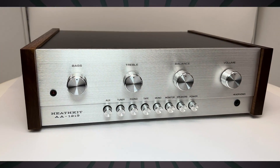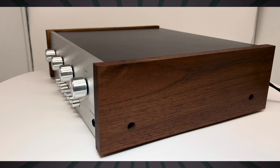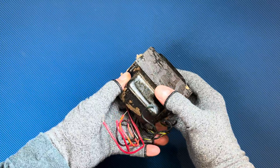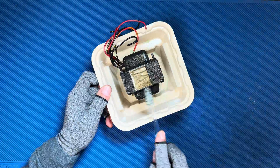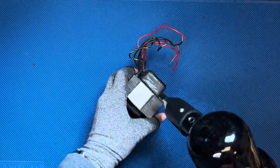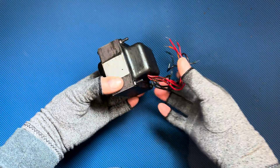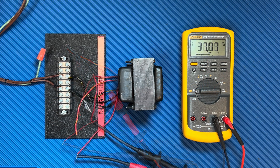To get to this point there were a few things I had to do that weren't covered in the build manual. Take the power transformer for example — it had been sitting for so many years that its paper wrapping had become one with the protective tar-like coating, so the transformer got a little bath. Replacement transformers can be difficult to come by with older equipment, so it was necessary to test it before getting too deep into the project. Once connected to high voltage, my multimeter confirmed the transformer was working just fine.